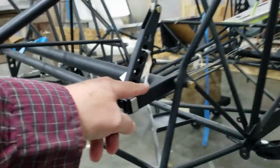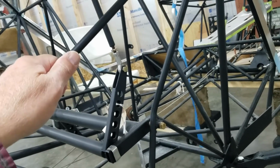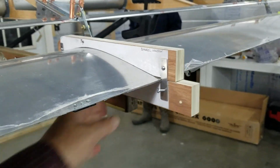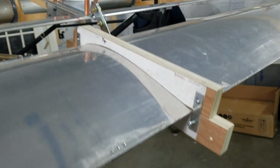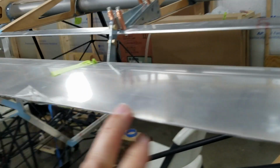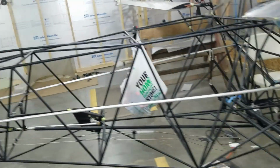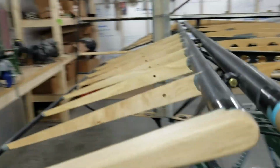This has got to be 11.5 degrees. This one's 32 degrees. That one's 26 degrees. The stick's vertical, supposed to be. And then you're supposed to have 28 degrees up elevator, plus or minus 2, and 15 degrees down elevator, plus or minus 2. We have 28 on the upside. We're getting like 14 and 13 on the downside. We've called it good because we just wore ourselves out adjusting. I thought the rigging would be really easy. The elevator was easy.